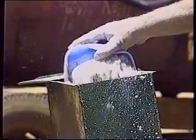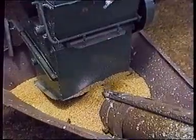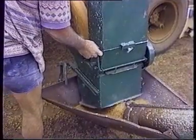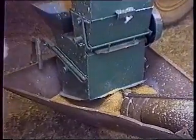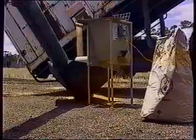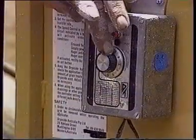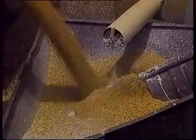Mechanical metering is the most reliable method. Inert dusts slow down the flow rate of treated grain, so you will need to increase the auger speed and slow the grain input rate to prevent stalling or blockage. One unit is driven by the momentum of the grain stream, rather like a water mill, requiring only simple adjustment of the outlet slots to obtain the recommended dose rate of 1 kilo per tonne. Another applicator is driven by a 12-volt DC motor with the dosage rate controlled by motor speed, adjusted to match the grain transfer rate.